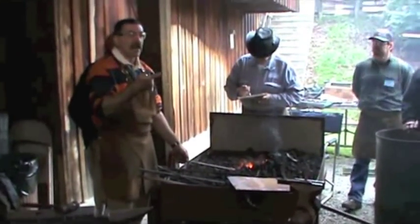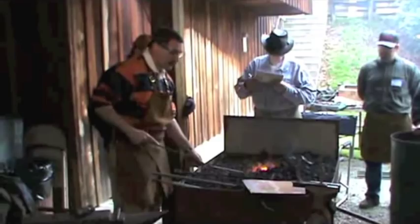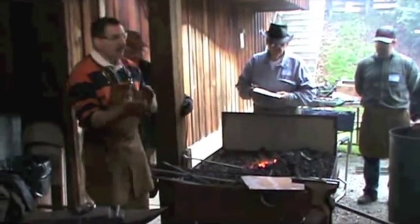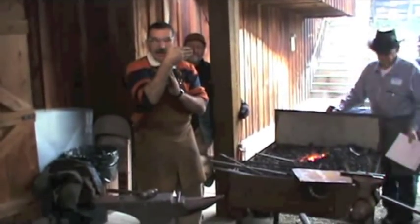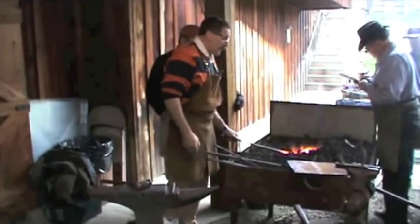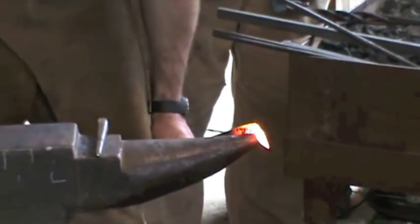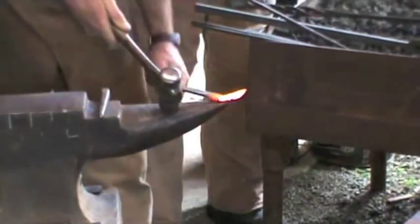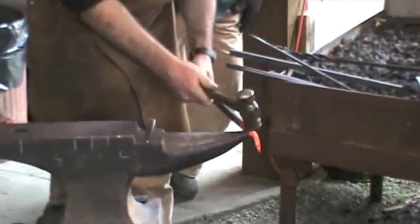All I'm going to do is while I have the heat in the other end I'm going to use the heat. I'm going to bend the scroll to 90 degrees with the step on the bottom of the bend. Keep that bend as tight as you can. I want it to look like a piece of half-inch round to fit in there, not like a piece of one-inch round. Put this stuck out about three-eighths or so, just drop the hand as you lower the other hand. Give a nice tight bend. If it happens and you end up with some bending down here, take it out.